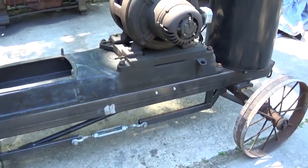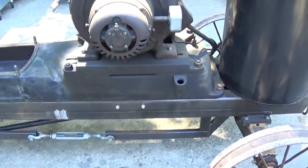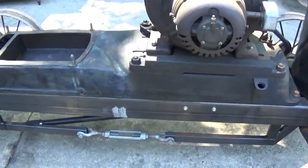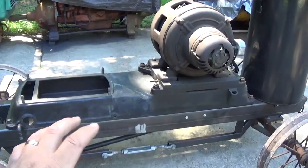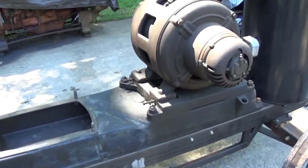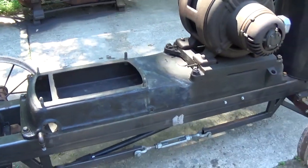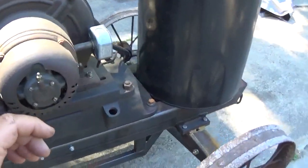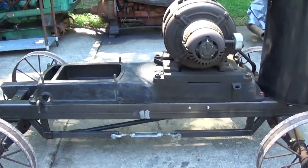And I think that is partially my fault, because the fuel tank's original pipe plug here, which is just a 1-inch pipe plug, had a hole drilled in it for a vent. And I'm pretty sure over the course of a couple years, I had a bit of condensation form, because this is a big piece of cast iron. So you can imagine that on cool spring nights, the whole unit would get cold soaked. It would become just cold iron and cold fuel. And then on those warm, humid mornings, you would get humid air moving into the tank, and it would condense on the top of the tank here and drip down into the sump. So that's one thing that I'm going to have to really keep an eye on, is A, making sure that I replace that cap with an actual plug instead of a vented plug when I'm storing the unit, and B, trying to keep the tank as full as possible for storage.